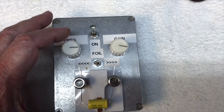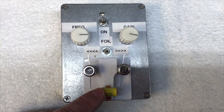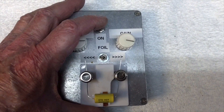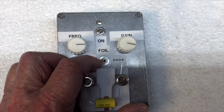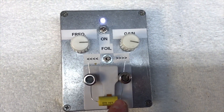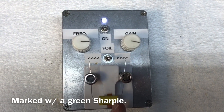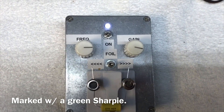Replacing the caps, I used my outside foil indicator here to check all the replacement caps that went back in the radio to identify the foil side, which based on my design with the LED lighting would be this side.